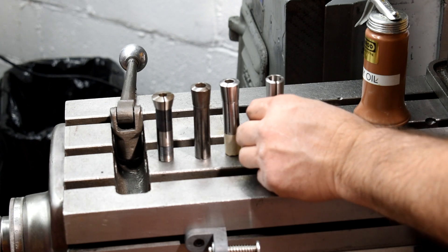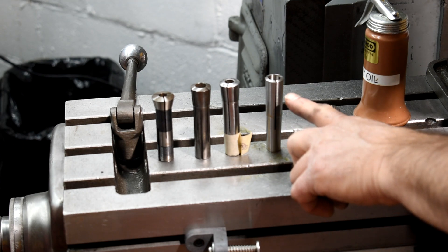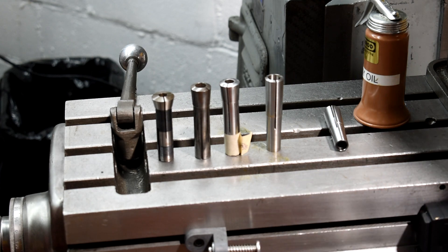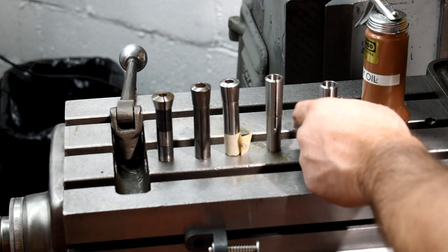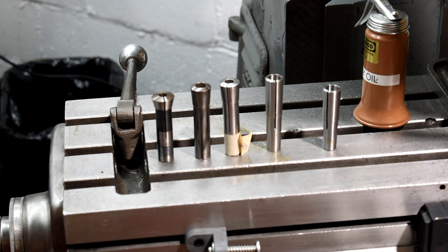Here was your number seven Brown and Sharp collet, and this is the one that kind of fit, but the collet stuck out of the nose of the spindle quite a bit. With the snow and ice, all the deliveries were delayed. This was the last collet I got — this is the Morse Taper 2 — and that is the collet that fits in the spindle. I didn't get it until Monday; it took over a week to get it. Not really knowing which collet I needed, I only ordered one.